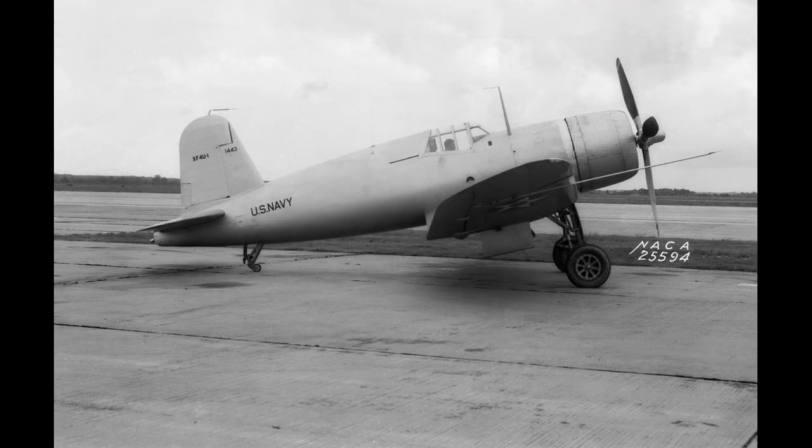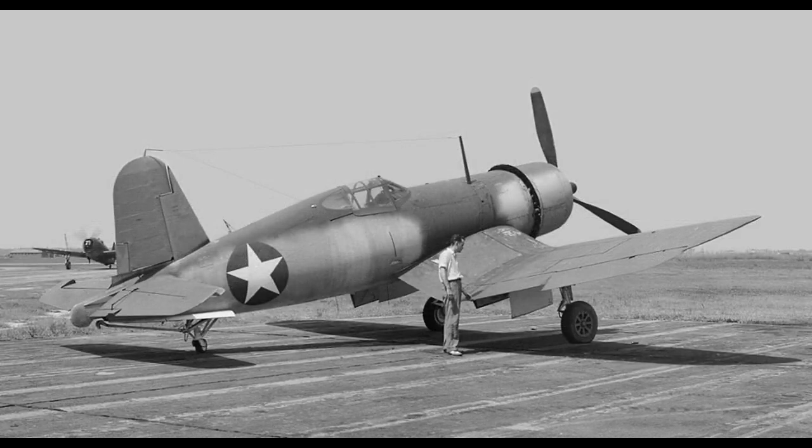Originally, the Corsair's cockpit was located conventionally. Due to a pre-production armament change to 6 wing-mounted 50 caliber machine guns combined with the wing folding mechanism, there just wasn't enough room left in the wings for large fuel tanks, and the Corsair's R2800 engine needed a lot of fuel. Since both fuel and self-sealing tanks are heavy, the tank needed to be located over the plane's center of gravity for balance reasons. The only way to do that was to put it about where the pilot sat and move the whole cockpit back, so that's what they did.